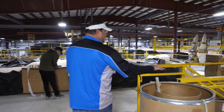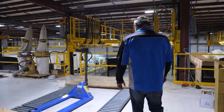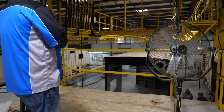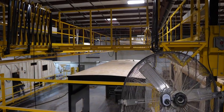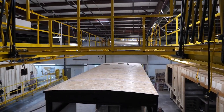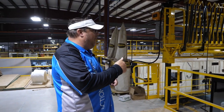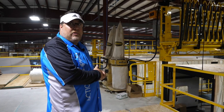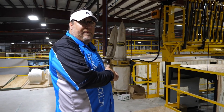It takes a lot of wire throughout the manufacturing process. Coming over to this station, we call this roof decking. We're taking 3/4-inch OSB sheathing and putting it on. Everywhere you see a little white streak is a piece of fiberglass tape run across the seams. They take a grinder and grind across all those seams and fasteners to make sure there are no protrusions sticking up, so that when we install your rubber roof further down the line there are no penetrations or punctures. This group is helping the group down there be the best rubber roofers they can be.